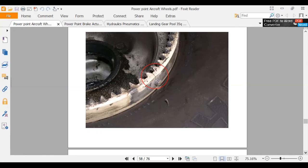This is a Goodyear wheel brake. And the reason I know it's a Goodyear is because a Goodyear has these teeth. We can see it looks like there's maybe some corrosion going on there, but we've cracked from the bolt hole. When you drill a hole in metal and you make a bolt hole, you have less material here, and you have a stress riser, so it probably started there and cracked its way towards the hole, and it wasn't as rigid there. So okay,